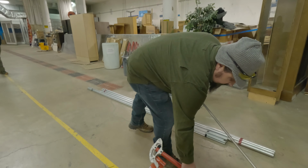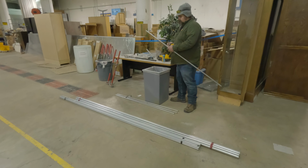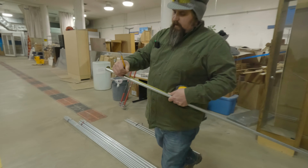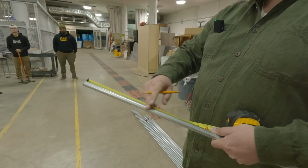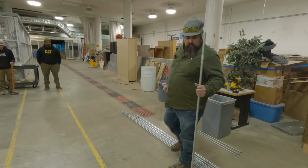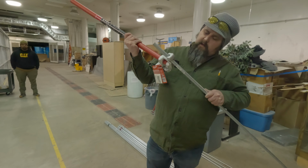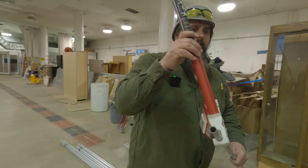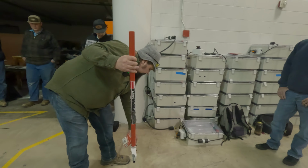On your take back, I'm just going to start on the other end of this one. So you got 6 inches back on your take back. I'd start 6 inches, so your 90 is going to be in this next 6 inches, if that makes sense. And on 90s and offsets like 30 degrees, you're always going to want to try to find a wall or something solid and level that you can hold yourself against.